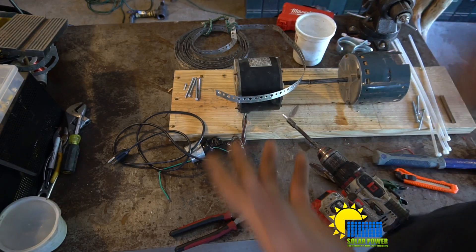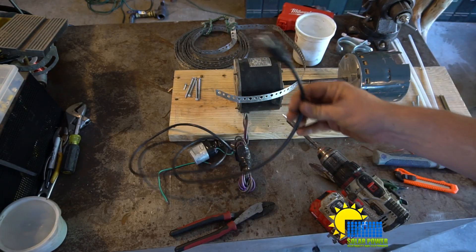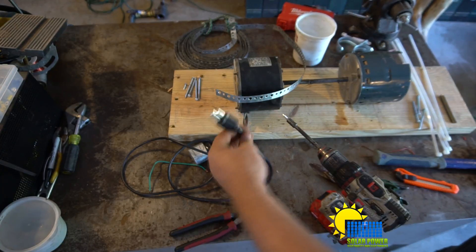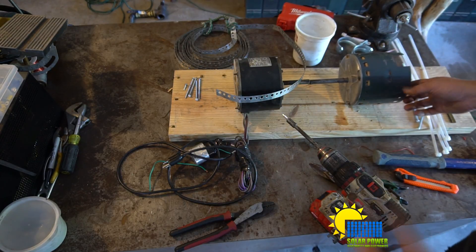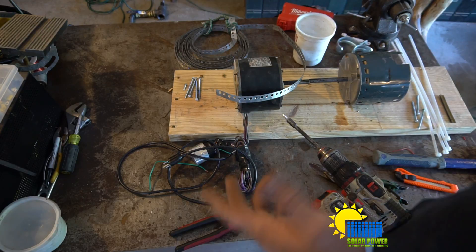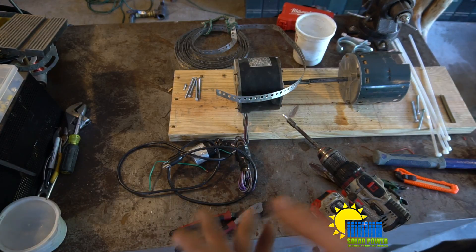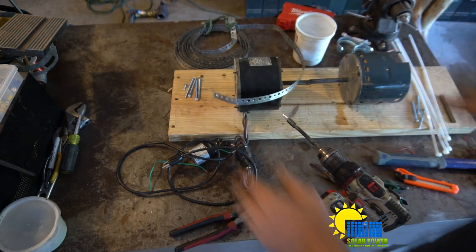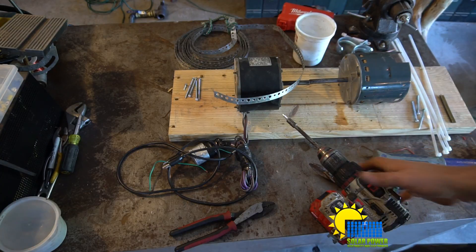What we're going to do is attach the shafts between these two motors. Why put a motor on one side attached to the other? Well, this motor you can plug in to your solar power, wind turbine, water turbine, or just plain old electricity. If you want three phase power - I believe this is three phase - I wouldn't plug something in that's three phase unless I checked on an oscilloscope that I've got 60 hertz at the voltage I'm trying to run at. I'm assuming it will, but I can't promise it. I don't have an oscilloscope - they're expensive. We're going to make what I believe is a three phase generator, and if anybody has an oscilloscope to lend me, I'd be happy to ship it here and back.